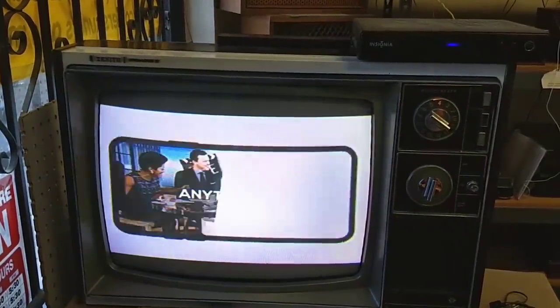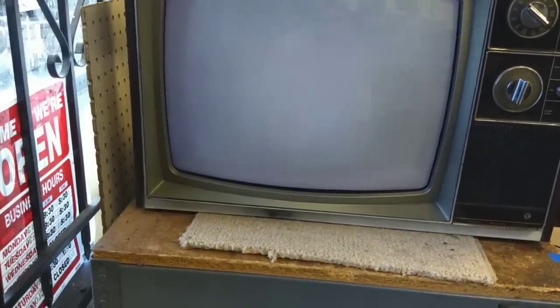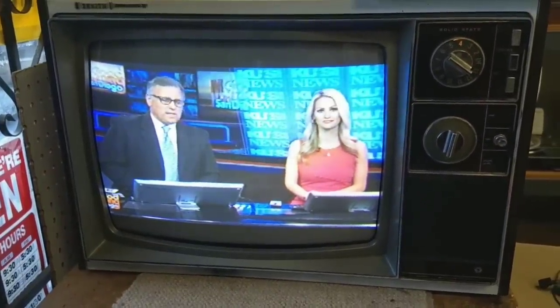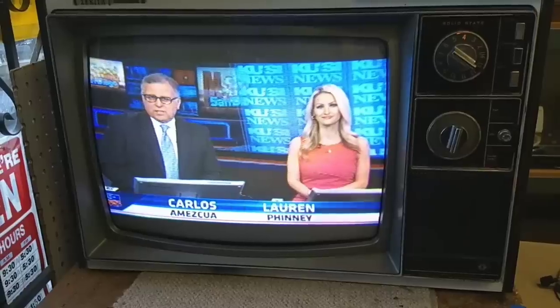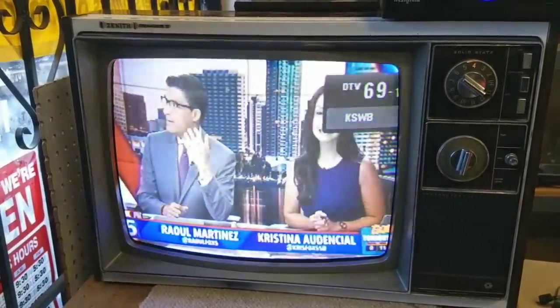So, I need to figure out what's going on there. But, you can see, like, right now, the no signal thing is so blurry. The scan lines go away. It's not very clear. And that is really super defocused. So, this thing's just totally weird. And, my digital's gone out again. See, with a full screen, it blooms to the point where you get massive overscan, but it's kind of sharp. But, otherwise, when the picture's not there and it shrinks back down, it's blurry again. So, we've got some sort of issue. It's too hot.